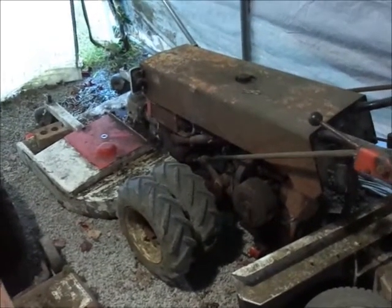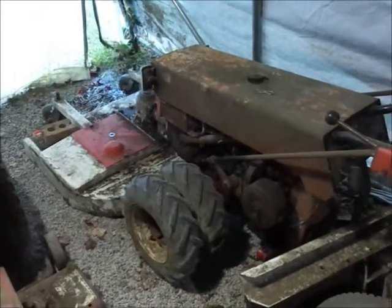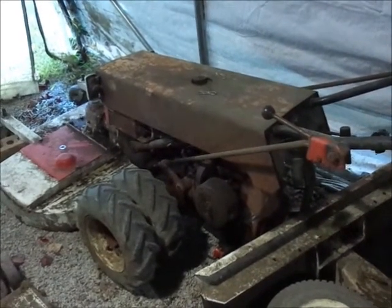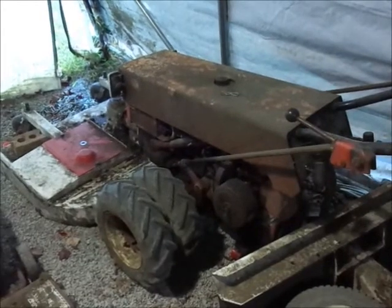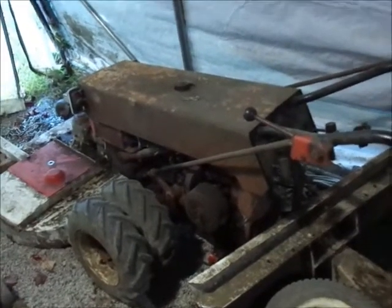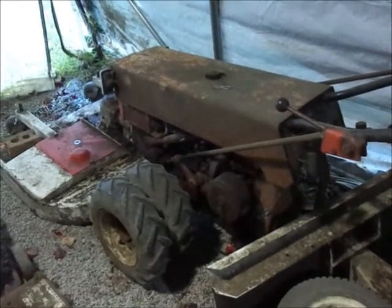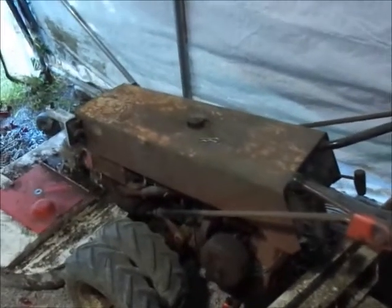Along back behind me here, what I believe is around a 1978 526 — better known as Wally. I just haven't used Wally too much; I tend to get it out and put it around the backyard as a really good spare tractor. This tractor is really rusty and the reverse clutch is starting to go out on it — it slips some. If you try and back up a real steep hill it'll slip a little bit. There was also something weird going on with it — maybe axle seals leaking — but other than that it was doing okay.